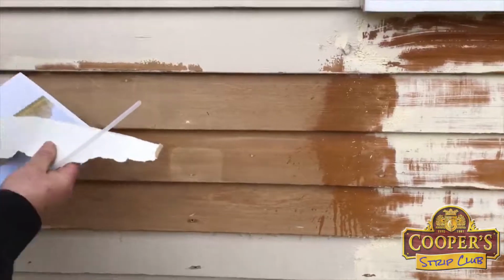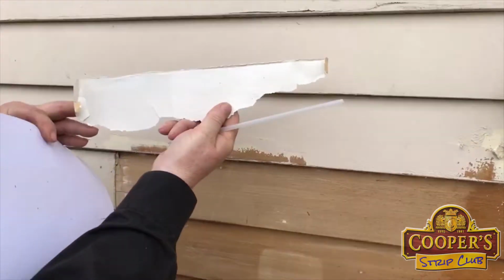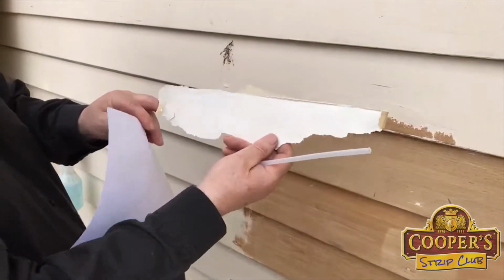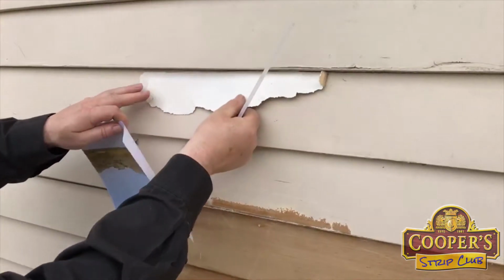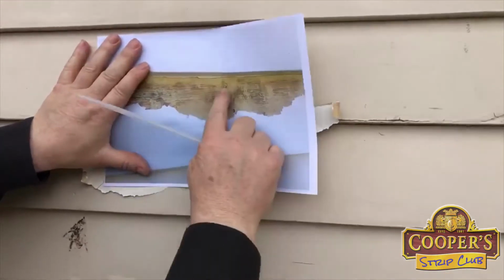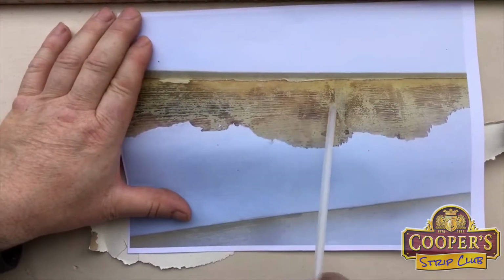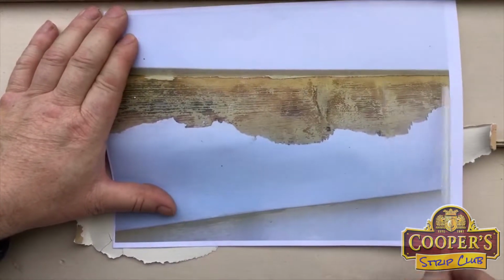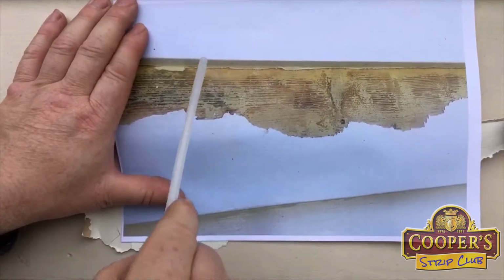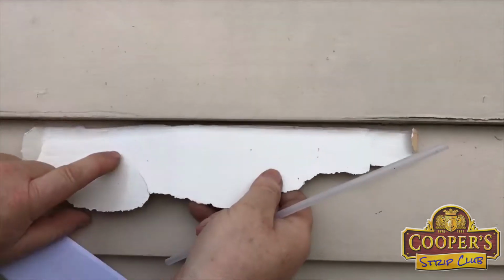Now, I showed this on Sunday, and I'll show it again because this is relevant with the fact that we're doing weatherboards. This thing I got looks like a bit of cardboard or wallpaper, but it's actually paint from Oamaru, that's right. It was sitting on someone's house, and someone had heat gunned or blowtorched it, and they'd actually damaged the layer of lead. The lead often looks almost like cake icing where it's been smoothed over, and the lead had been damaged, so when the acrylic paint was put on top, the paint just dragged it off.